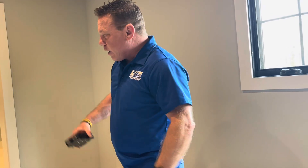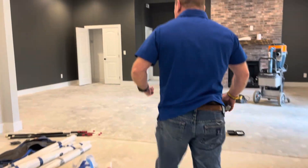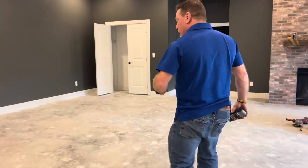If you get very much higher than seven, you need to rethink what you're going to do, because that means there's so much moisture coming up through the concrete that nothing's going to stay. That means there are other water issues going on.